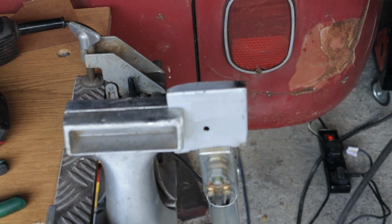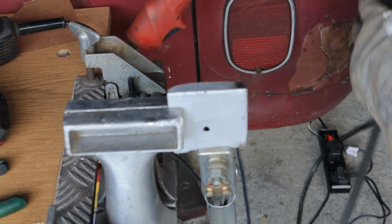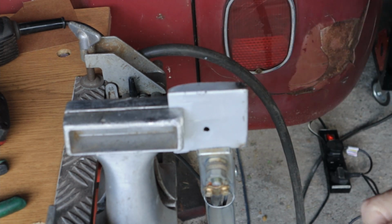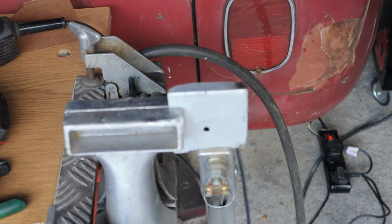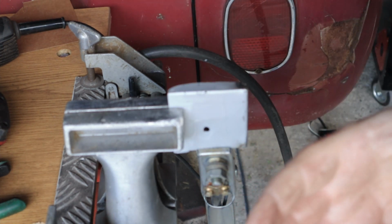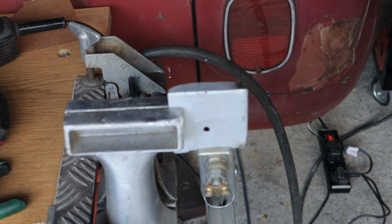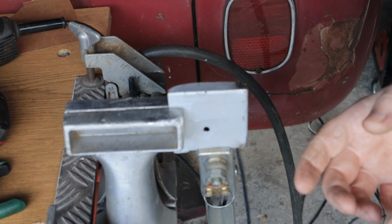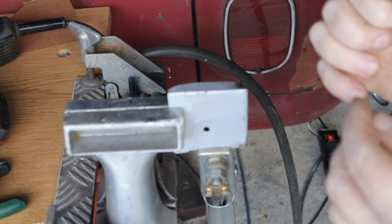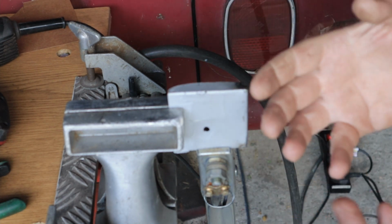See, that's what I'm talking about. I'm going to do a little bit of bragging here now, and I'm just going to show you exactly, because I can talk until the cows come home, and like I said, I will. The thing I'm talking about is that first tack on the outside, and on really light metal. If you can't register that first tack efficiently, properly, and just lay it down there like that, then the rest of the thing can be a disaster for you.